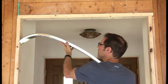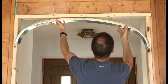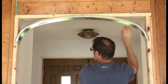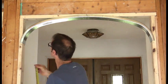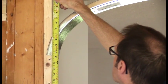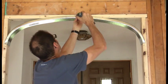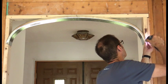To install the EZR, you just bring the arch over to the opening and fit it in one leg at a time over the two-by-four or two-by-six, then the opposite leg as well, and push it up into place. You need to make sure it's level — I measure down from my header to where the arch actually starts. In this particular case it was about ten and a half inches — that's my rise. Then I install drywall screws, typically in three places: right at the spring line, up into the center, and then on the other spring line.